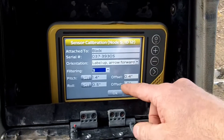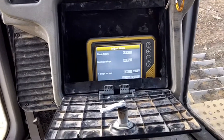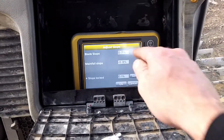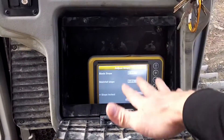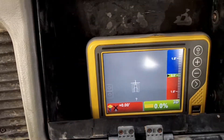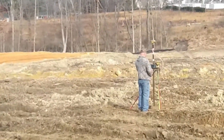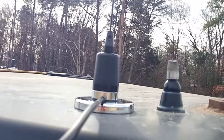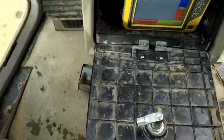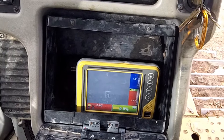Three for filtering is good — we've noticed that. I think we've got it now. If we slope the blade it goes to zero the way it should, and if we raise the blade we have our main fall slope of the actual blade. We lost radio for a while and still haven't gotten it back — I have him over there restarting his base. I have a brand new antenna on this system and still no radio. I've got to take this box apart.